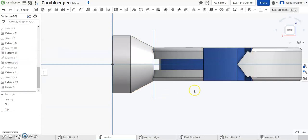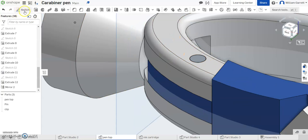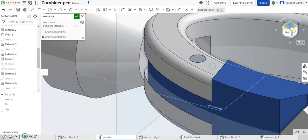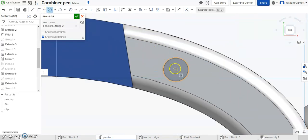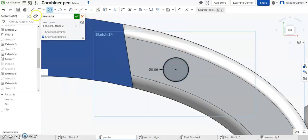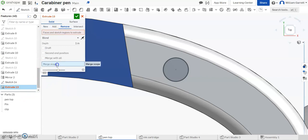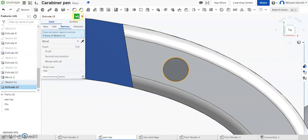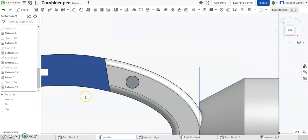I'm not done with it yet — we still have to add some holes and round off our edges. So next I'm going to add in this hole part by sketching on the top and cutting that through. All I have to do is a circle — you could reuse the sketch you made earlier, but I'm just going to finish this one off with a value of 0.06. Then we finish our sketch, extrude, set to remove, and tell it what to cut, which is going to be the clip portion — we don't want the pin to cut through. Hit our green check to accept, and now if we hide our pin we can see it'll break through the object.